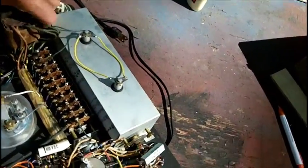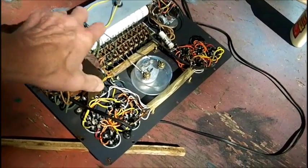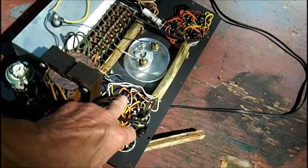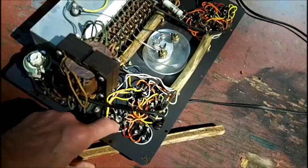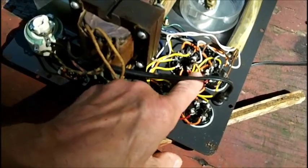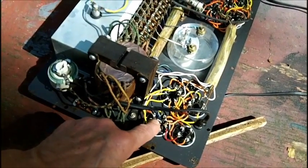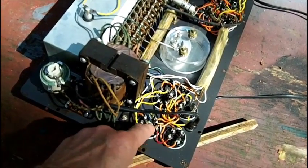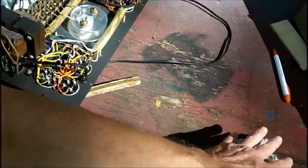So anyways, I want to let this get as much sun as I can get on it, but it's very musty, a smell in here. And these are put together as kits, as I said, and I knew that. And some of these pins were touching the way it was soldered. So I got in there with my eye-loupe and a lot of light, and I moved things around to make sure nothing was shorting out here. So we're going to just let that set.